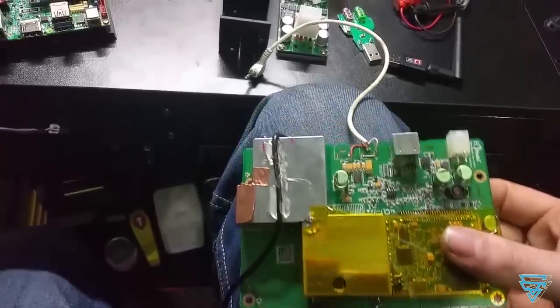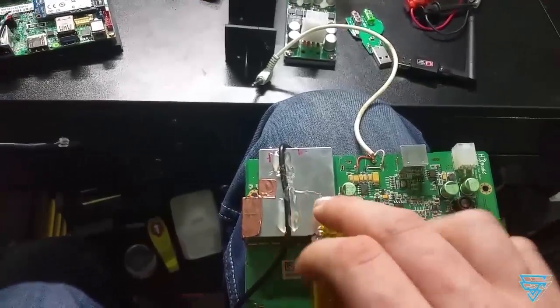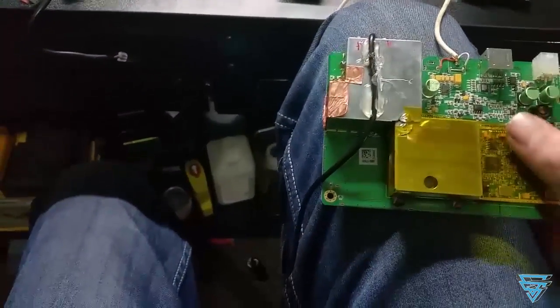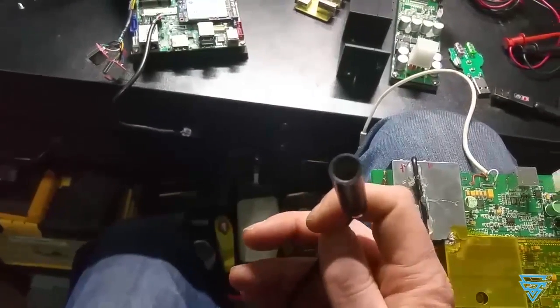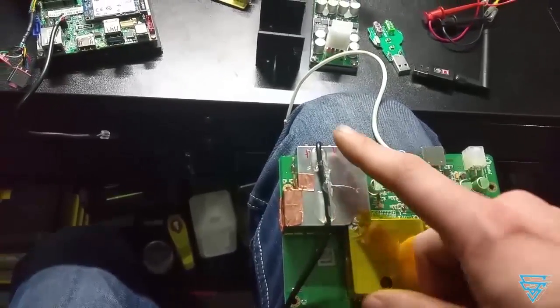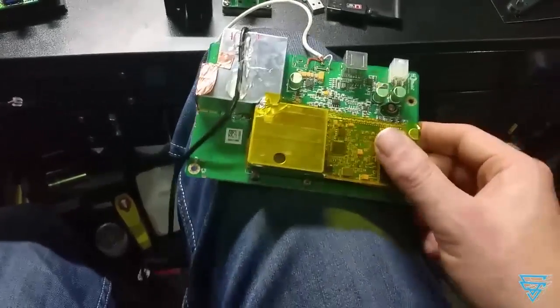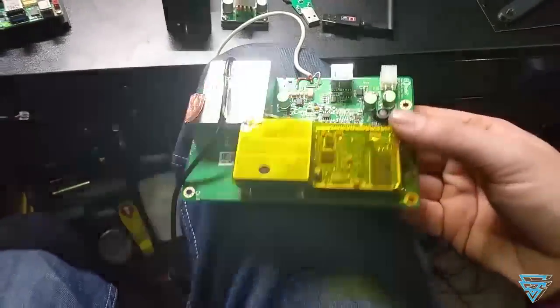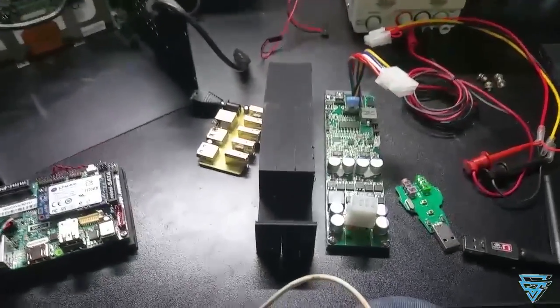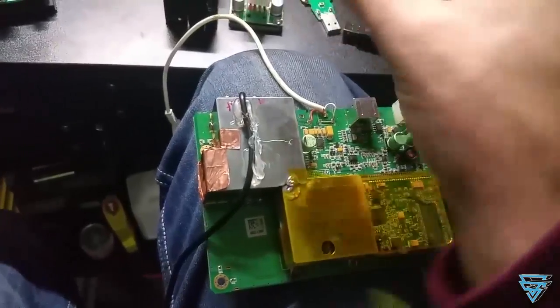You see I made some modifications to this one here. I took the RCA jacks off for space and just straight up put a headphone jack attached to it. I did have to remove this big metal piece, which is kind of a nightmare to do, and then I hand soldered the antenna connection so that I can hang it out at the back, and I hot glued it on here so if it got yanked on by accident it wouldn't pull those solder joints out. And that's pretty much all there is. You can see here I taped over the external electronics that were the highest on the board, so that when it was in, because it goes in there upside down, which I'm going to show you with that bracket over there, it actually mounts upside down to the top, and I didn't want the electronics touching the hub.